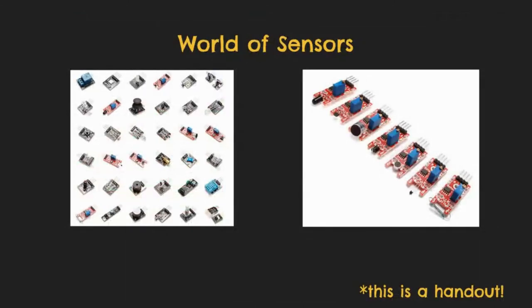I've got loads and loads of little sensors and sometimes I just try to build a project based on whatever sensor I've got. This one here is a gas sensor — gas sensors are quite fun. This one heats up the air going over it and looks for changes based on what gases are in the atmosphere. Some won't tell you specifically 'this is methane', but it will tell you this is a group of volatile gases in this atmosphere. Each one has little pins and those little pins connect up to the pins on your device.